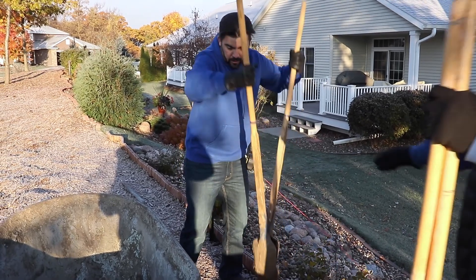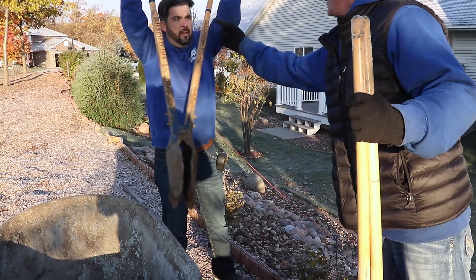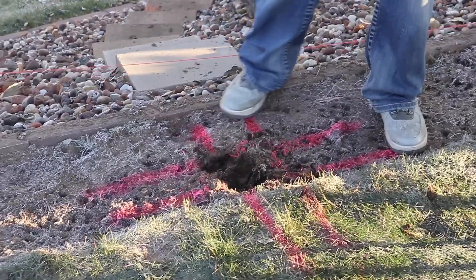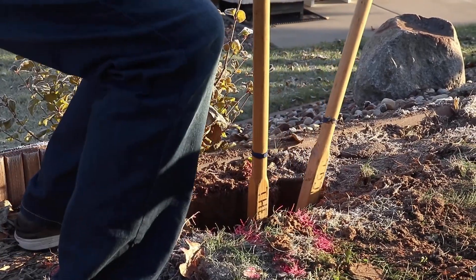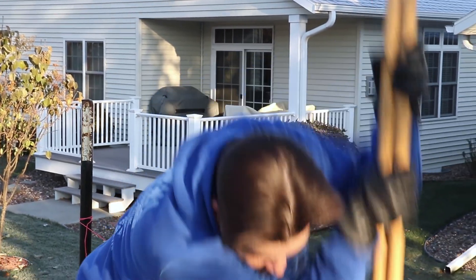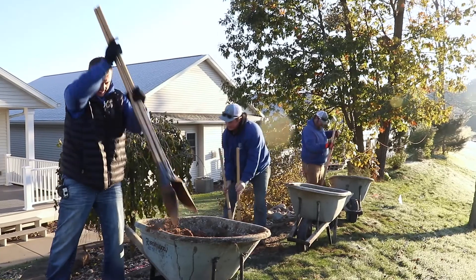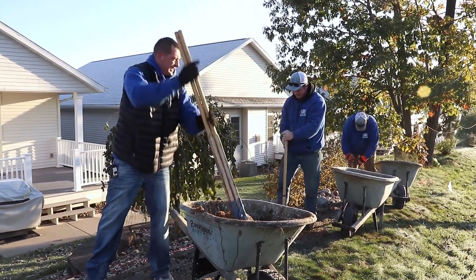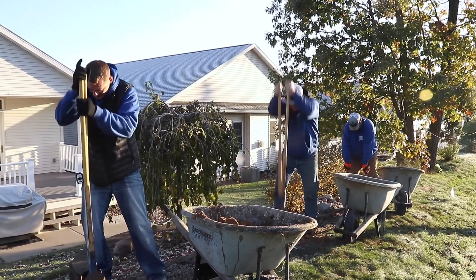These are your indicators — that's when the hole is deep enough. They spray paint the ground like a hashtag, and your job is to make a hole that's probably about a foot in diameter and then dig it down and shape it like a bell — the bottom is wider than the top. The whole goal is to get that bottom really flat so when they get the concrete and the post down in there, everything sits nice and level and doesn't get water under it.